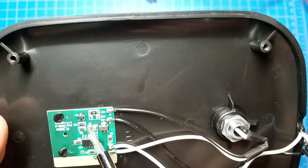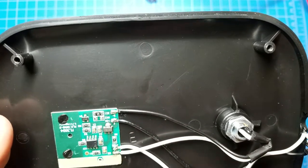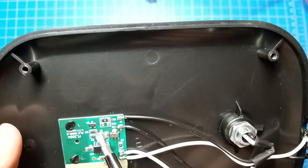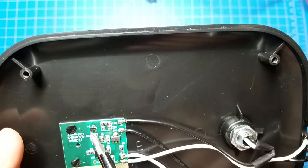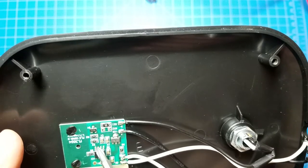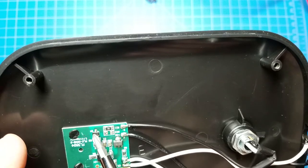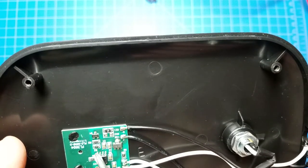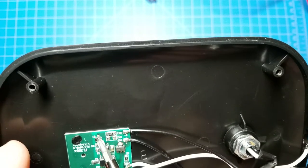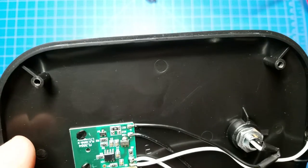And a 150-ohm resistor that snakes around to the microcontroller. So this 10K resistor pulls what I'm guessing is the gate to ground, and then this 150-ohm resistor, when the microcontroller sets that pin high, sends more electricity to that pin than can be sent through to ground, dragging this pin up to high, turning the MOSFET on, allowing electricity to flow to ground, turning the LEDs on.